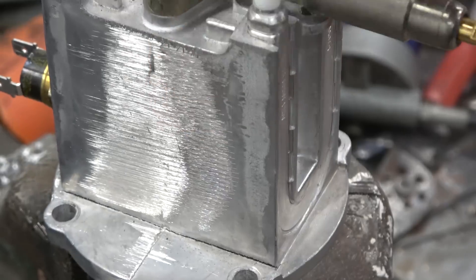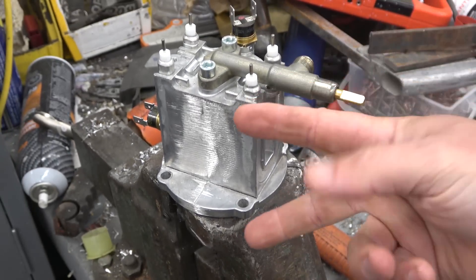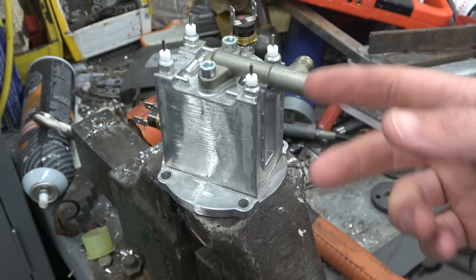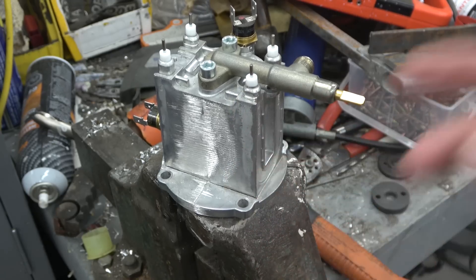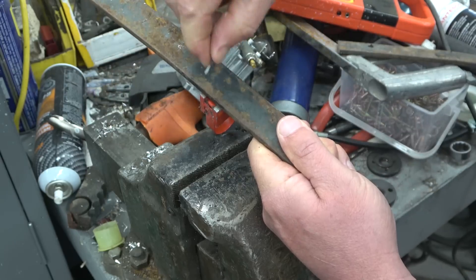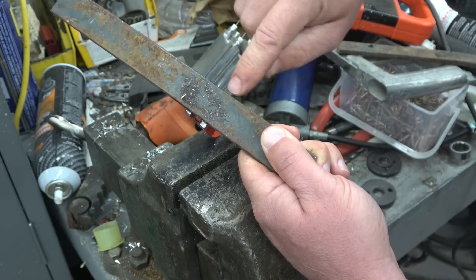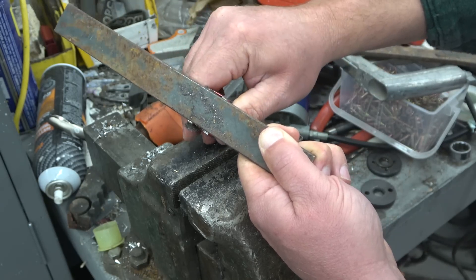How could we possibly find cracks? Well, there's a device called a Magnaflux, which is a name brand. It's essentially a magnetic yoke, and it can be AC or DC. They put it up there and then they sell this consumable dust — and the dust happens to be iron powder — so it works very well for ferrous cracks. We got a contiguous piece of steel, we put a magnet on it and then we put some magical pixie dust on it. It doesn't really stick all that well, because the magnetic flux is going through the high-permeability magnetic-permeability steel and it's not going through the air.